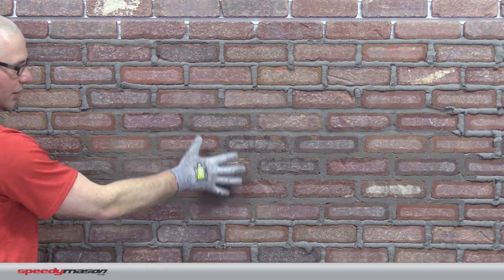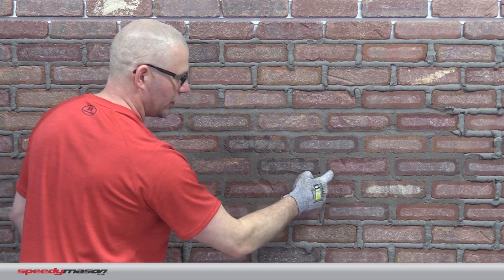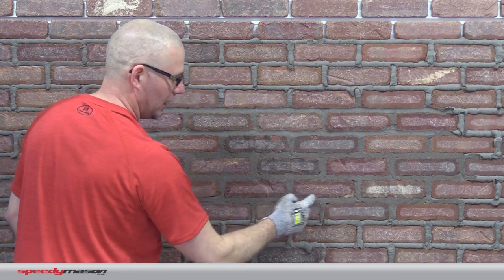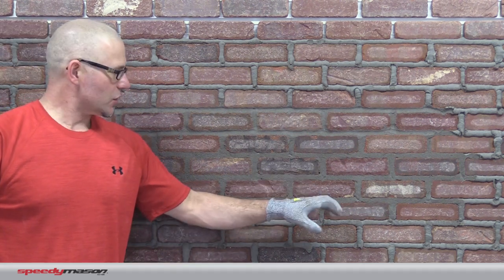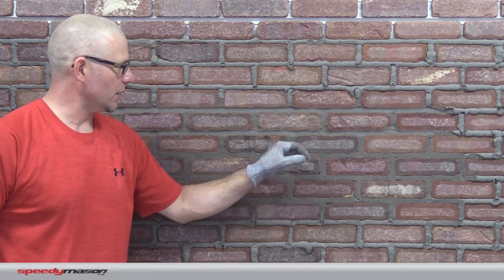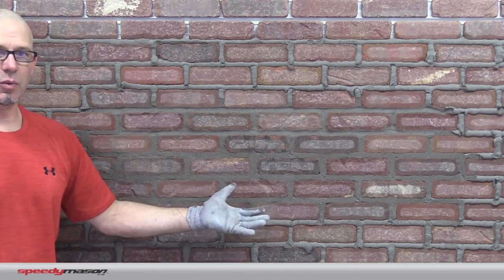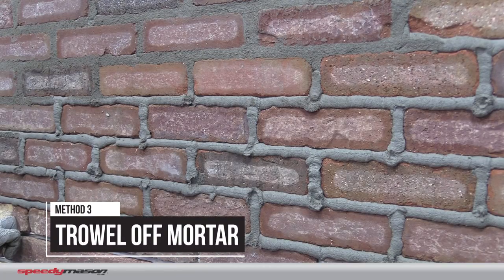You can really see the difference in look. One thing I'm going to point out here is you see all this moisture that's in this brick. What this brick is doing is it sucks all the water out of the mortar, so you're going to see this wet spot around the brick. But obviously when this all cures up and dries out, that's all going to go away. Another technique is you can simply just trowel these joints out like this.